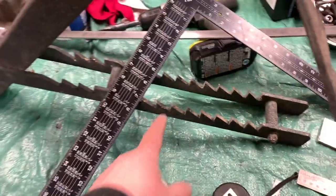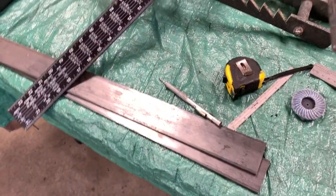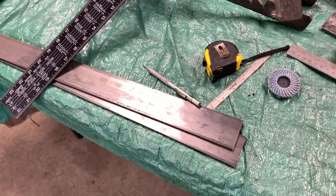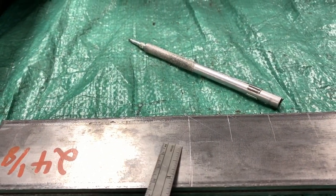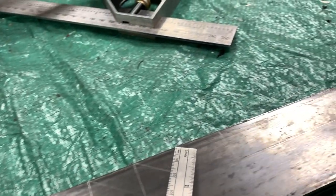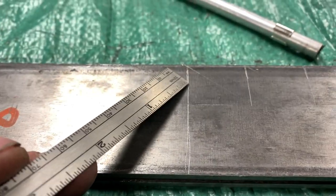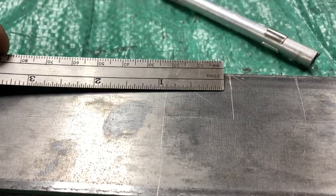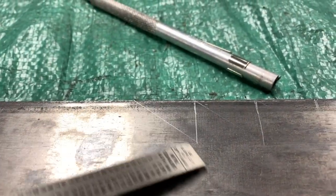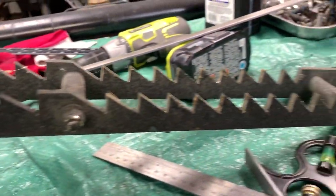And now we're gonna do this one here. You need short teeth for this. We're gonna lay that out and cut it. That one's gonna take a little longer. So I just drew out this, and it's 5 inches from here to the end, and then it's 15 inches that I laid out to here, and it's 3/4 of an inch down. Like I said, this is an inch space, so you guys can visualize, and then cut a line, cut a line, cut a line, and then down. And that's gonna give us this profile.